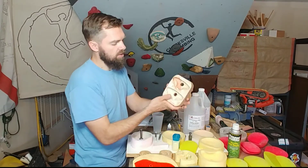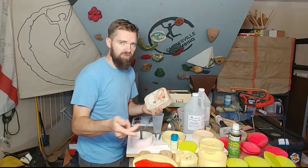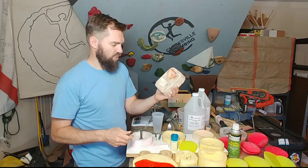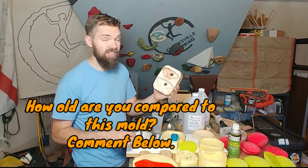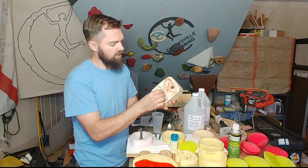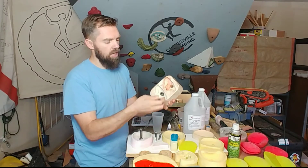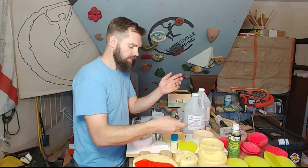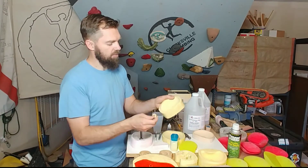Because this is something that fails — that's the first thing that's going to fail in your mold. This mold here is actually from probably the year 2000 and it's still a good working mold. I designed it so you have this dowel system that goes in there — a two-part dowel system for your bolt head and your bolt hole. That works quite well, but I stopped doing that out of simplicity and now I'm breaking my molds.